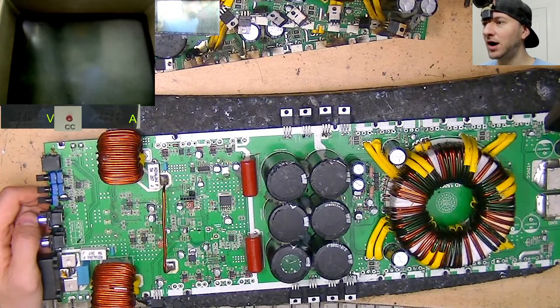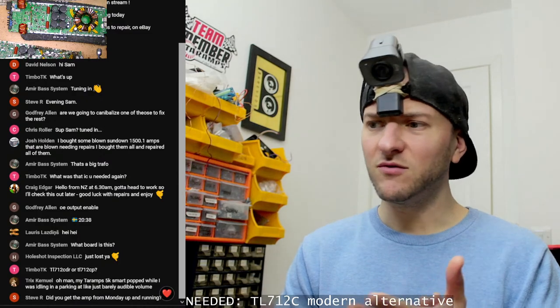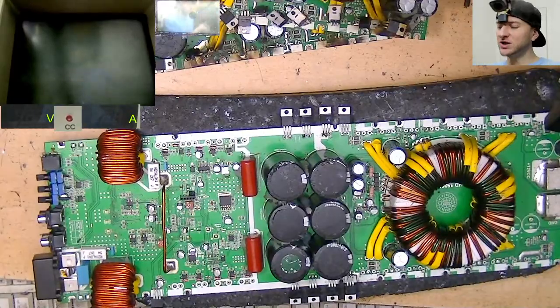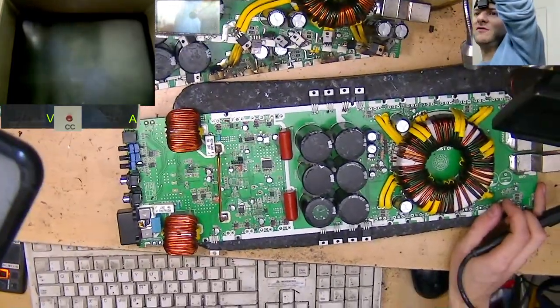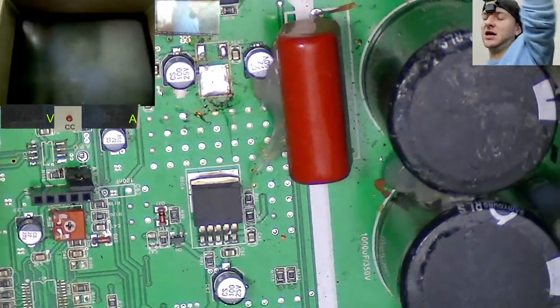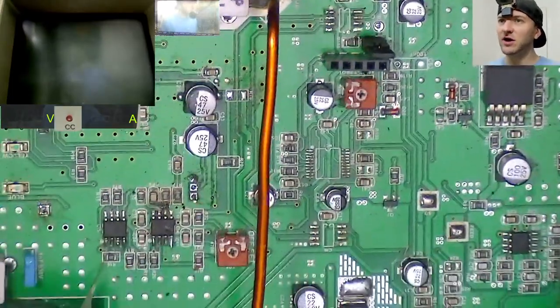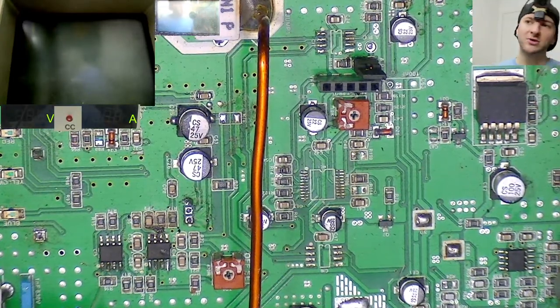My Smart 5K popped while I was idling in a parking lot, just barely audible volume. That sucks. Honestly, that is actually how most amps fail. Rarely ever hear of amps failing when they're heavily under load. It's always when the music's on low or just on startup or just idling. Really frustrating. If it's one of the earlier Smart 5s, then they had a weak point with the output inductors.